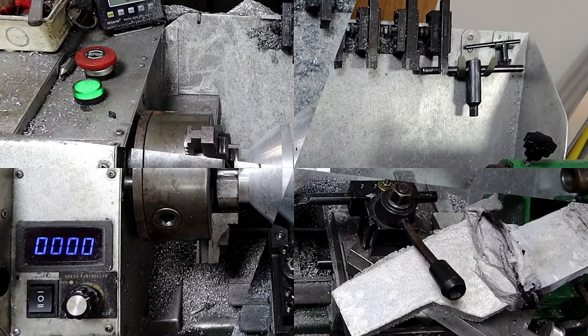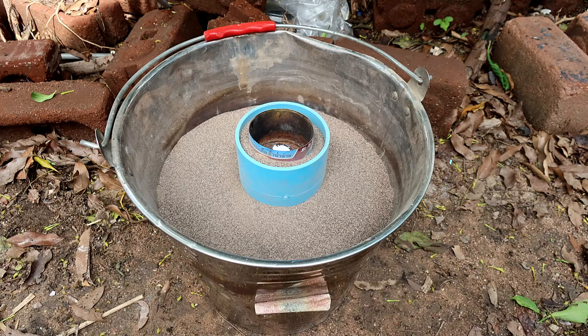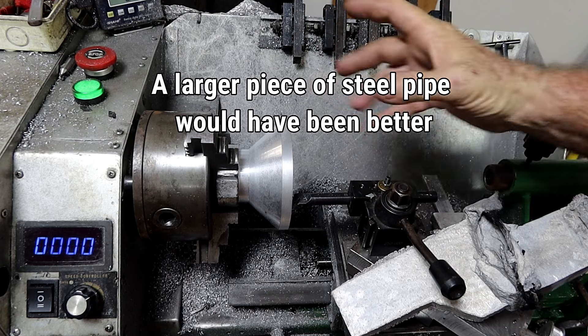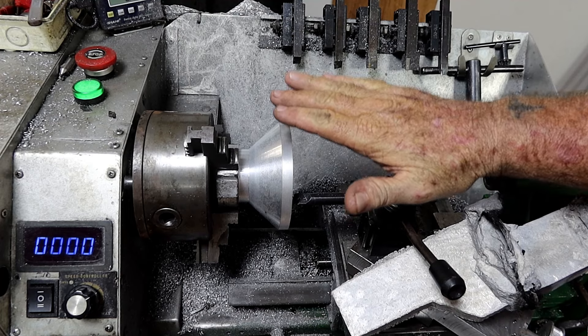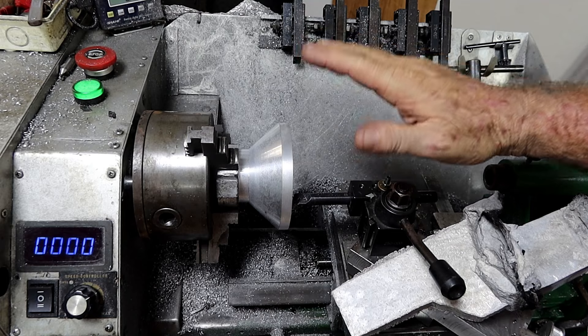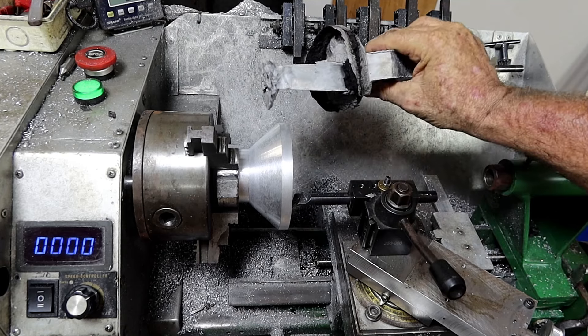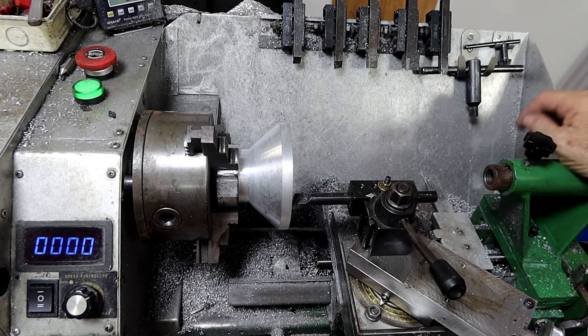Thankfully the sun was out this morning so I got another crack at casting the mounting plate. I've tried something different to try and contain the metal up top - it's a problem because I don't have enough sand in that bucket. I went to the hardware store and grabbed a PVC collar to put around it, then packed it full of sand. It seemed to be going well, then the can on top started to float upwards, kicked sideways - I gave it a tap with the crucible and this is the result. I'm going to concede to the casting gods and give up on casting that.